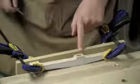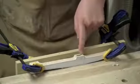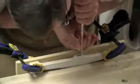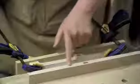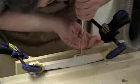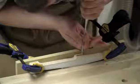I'm going to pare these walls carefully. I don't want to hit it with the mallet now because there's very little wood between the curve and where the mortise begins — I could easily pop that end grain out. This is the advantage of chopping the mortise before shaping: you have all the wood backing it up. Once the curve is cut, you don't have much material and you can blow through the mortise more easily.